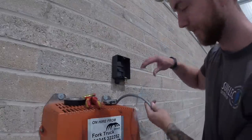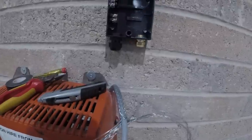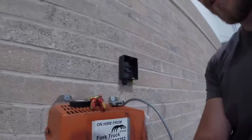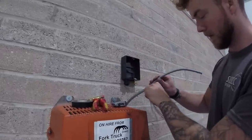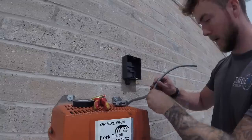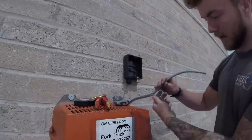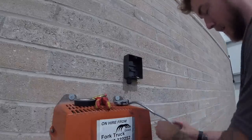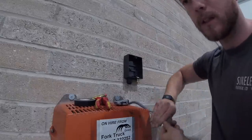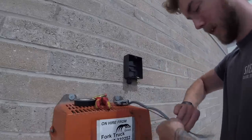Separated either side just like so. I've picked in between them all the way down there to split them right at the end. Now the next thing you need to do — because that's obviously metallic — we want to earth all that, so we're going to twist it all together, all the way down, nice and tight, so it's long enough to reach the earth terminal within the isolator itself.